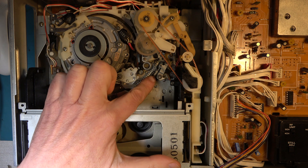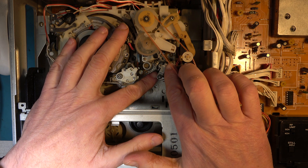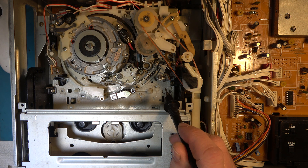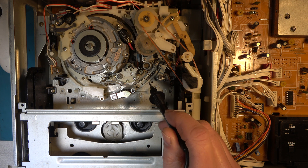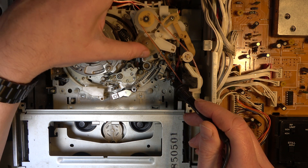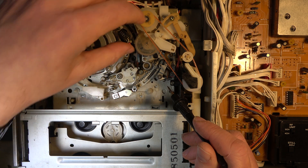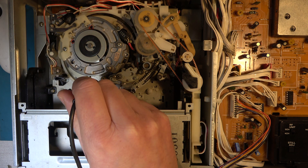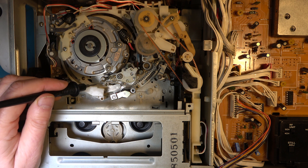What it's doing here is using a metal part of a rod - which is actually the hinge to this whole assembly - to swing the magnetic sensor into that, so it's seeing metal. That's a way of detecting that it's fully unlaced. If I very slightly lace it by hand you'll see that swings away, so now it's not seeing this anymore and the deck knows it's not fully unlaced. That has eliminated the microswitch which normally sits here, and more importantly I think, the unreliability of that microswitch.